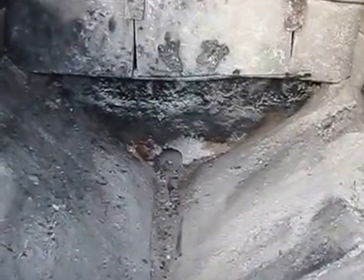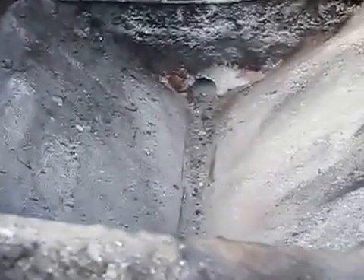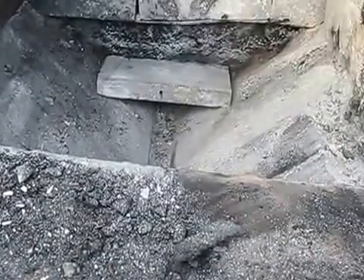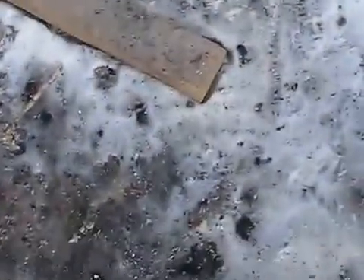You're probably wondering what separates the primary and secondary burn. I ended up just doing this with fire bricks, which made it really easy to separate and keep them apart. I put one fire brick right over top of that air inlet — I don't want all the ashes and charcoal landing right on top of that air. Then I add a couple more starting right up against this side, right up against the back, and you get an idea of what's going on. Still very hot.